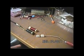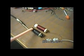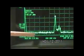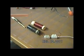So let me go ahead and connect that and show you what happens. Here's where the complexity starts to rear its ugly head. Here I've got the ground lead connected, and here's a coil. This end's open. This end goes through the 1N4148 into the first coil I showed, and this coil is actually grounded. This one's grounded via the diode, and our coupling arrangement is exactly the same to the spectrum analyzer. Look at this signal right here. This is a result of this particular coil configuration, the spacing between the coils, the SRF of the coils, and the fact that we have a diode in there rectifying half of the signal that appears between the two.